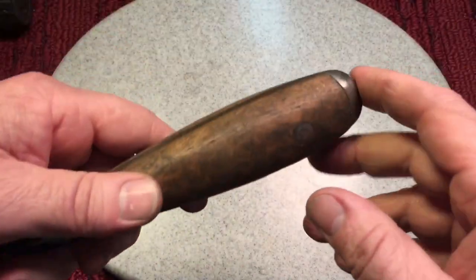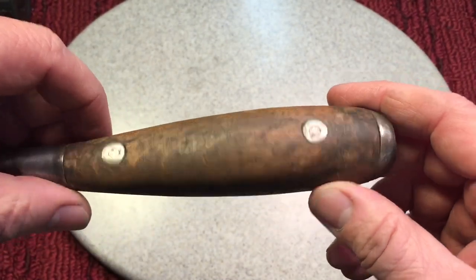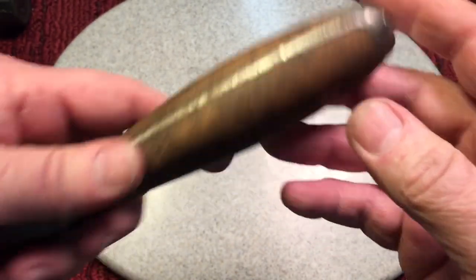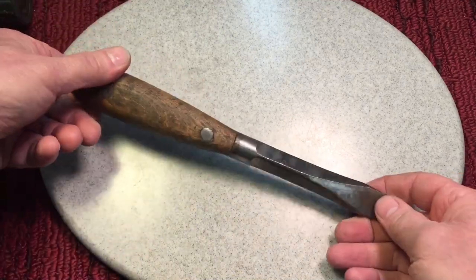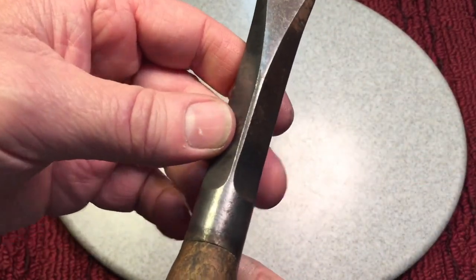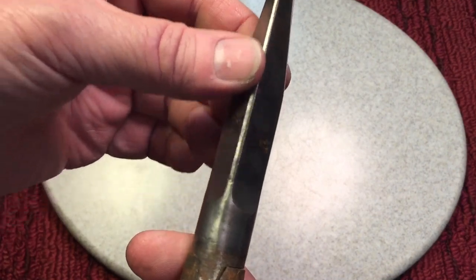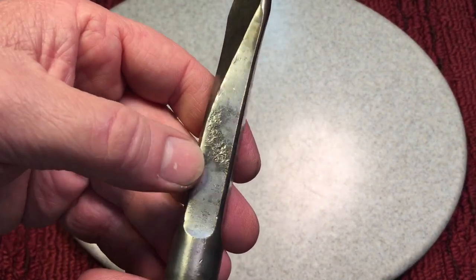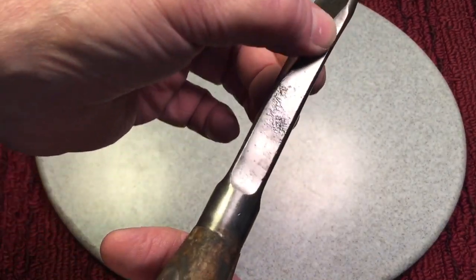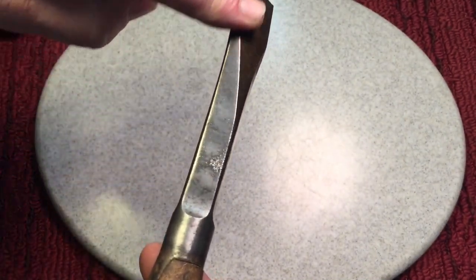The patina covers all that, which is why it's nice to have patina — you don't see it. And remember what the back looks like — we always like to do that up nice. We got a little bit of a crack here, and the scales are in good shape. Now for these square-shafted screwdrivers, grinding the facets is tougher than you think. You've got a flat on both sides and a flat on each side — nothing sharp. If you tried to do this on the belt sander you would get waves because the belt curves when you touch it and you wouldn't get that flat area. That's why I prefer the flap disc — you're hitting it from an angle and it flattens right out.